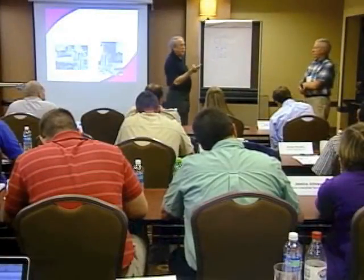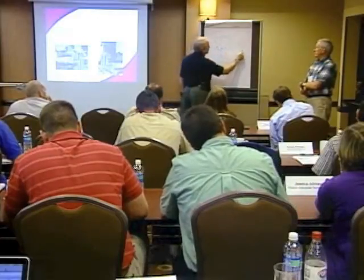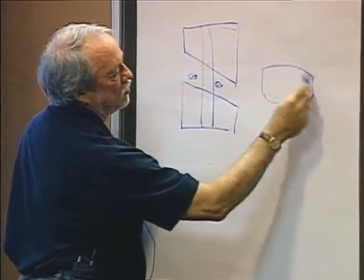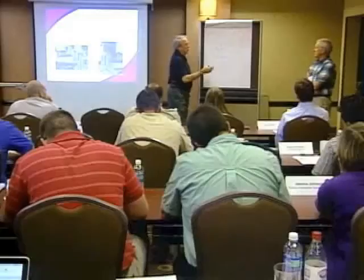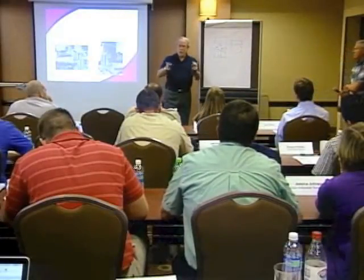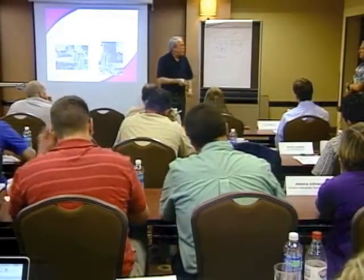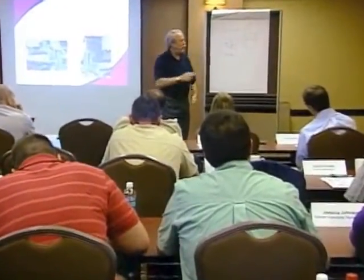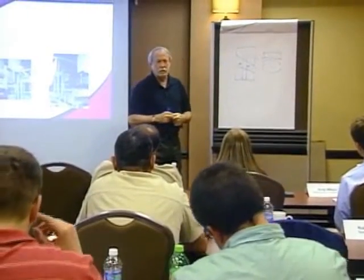We talked about crown pulleys. You guys might not know that, but sometimes you'll see a pulley with a crown. In other words, the outside isn't perfectly straight. That crown is used as a centering device for the most part, to keep the belt running on the center of the pulleys. You can't use a crown pulley as a tracking device for nylon core. That crown will fracture the nylon. It won't work. It'll destroy the belt.